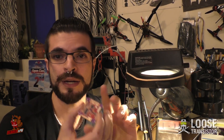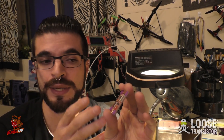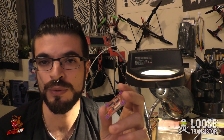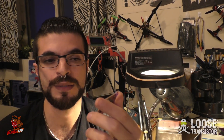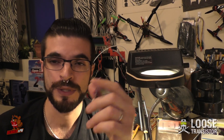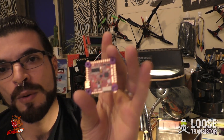The Helio Spring, as I mentioned, has a motion coprocessor. The way it works is it has an F3 chip connected to a gyro that handles hardware-level filtering, and then it sends that data over to an F4 chip that runs the flight controller software. This offloads a lot of work from the F4, giving it more time to run PIDs and everything else, and it allows it to run faster too. You can very easily pull off 32 kHz loops with this board, however right now most people are having better results at 32/16 or 16/16 — it seems to be a better output for the board.